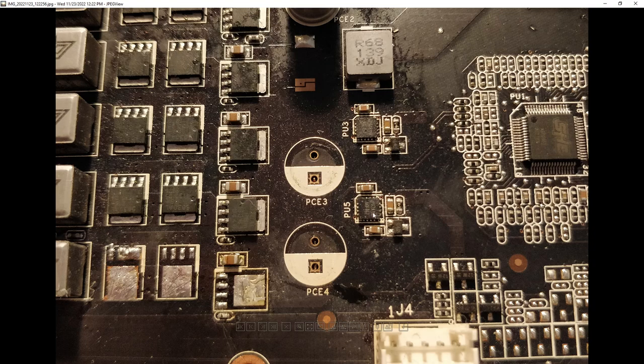There is a very slight difference between the drivers on the ASUS card and the MSI card. The ones on the GTX 570 are UP6282BD dual drivers, whereas the ones on the MSI donor card are UP6282AD. So there's that one-letter difference.